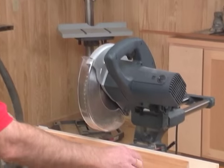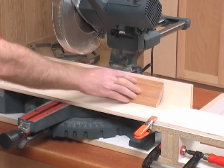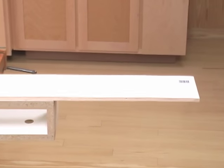For best results, I've equipped our miter saw with an auxiliary fence and table. The fence helps to cut molding in this position to rest against, and it needs to be just slightly taller than the molding. The table has to be longer for long pieces of molding to rest against, to keep them from teetering when you're making your cuts.